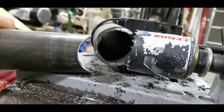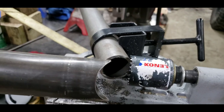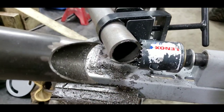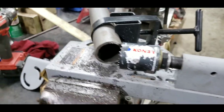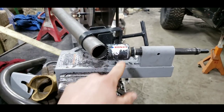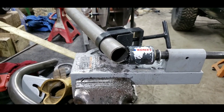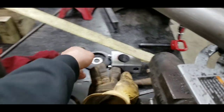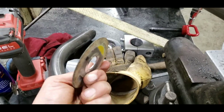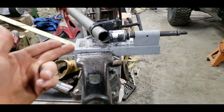This notch here was done with this hole saw — that was a zero degree notch and this is a 45 degree notch. Worked out perfectly. This Harbor Freight notcher was about 65 dollars, and the hole saw was about 12, so for less than 80 bucks you've got a great little notching setup. I used to do everything with a grinder — grinding wheel, cutoff wheel, flap wheel — whatever I could to make the job happen. For those of you that are new to this, you can get into a notcher for 80 dollars.